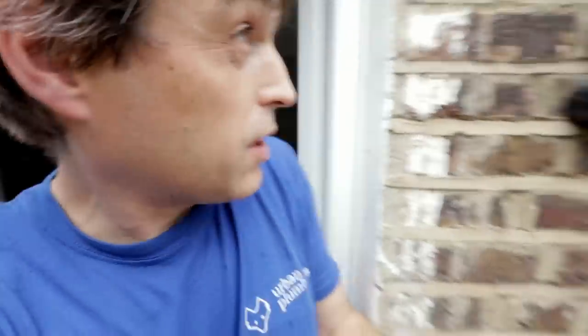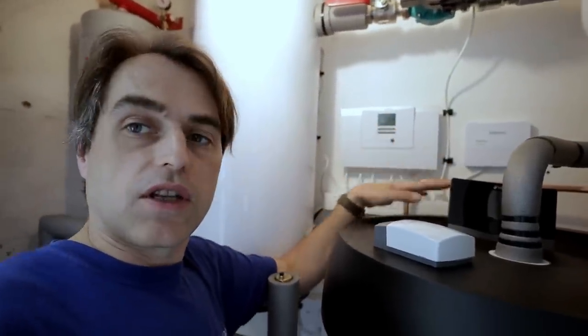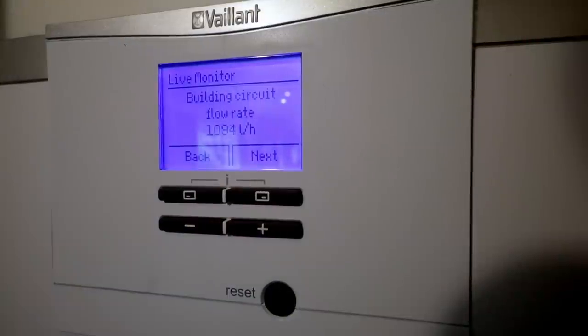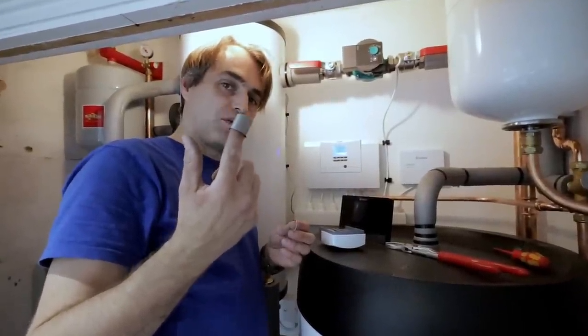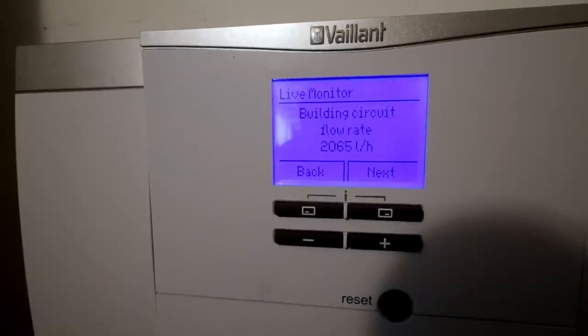Now I have to stick my head out and turn this setup on in the rain. I just fired the unit and I'm in the middle of commissioning — I still need to put the external sensor outside, but the unit is running on hot water right now because the temperature in the store is only 27°C. The unit outside is running — you can see the foliage being moved by the air from the unit; it's pretty decently quiet. I should be getting close to 2,000 litres per hour on the unit. I wasn't getting the expected flow rate — I was only getting half that. Again, as on the last job, that little strainer was reducing the flow in half from 2,000 litres to 1,000 litres per hour. Who would have thought? So I'm taking it out and will come back to swap that ball valve for a bigger size.